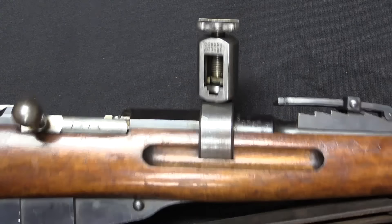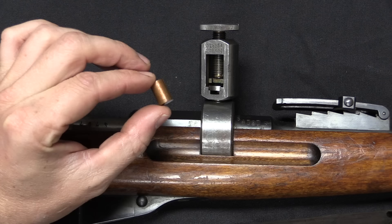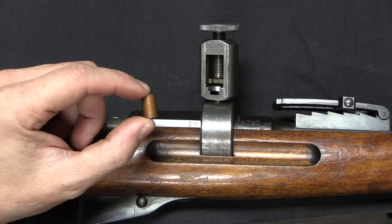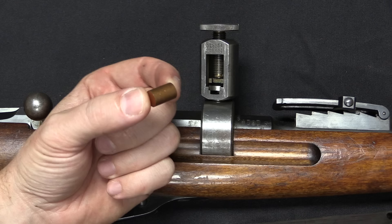The answer to why there is a thing growing out of my Mosin is of course that it's a pressure testing rifle. The answer to how you determine pressure is: you take a piece of solid copper and you see how much it squishes when you expose it to chamber pressure. This should be a good reminder of just how much pressure is in that rifle chamber when you pull the trigger on a live cartridge. This is only a .30 calibre cartridge, and you're going to measure its pressure by physically squishing this solid block of copper down a measurable amount — that's no mean feat.